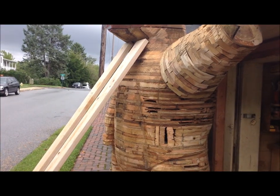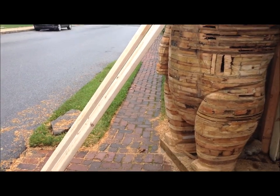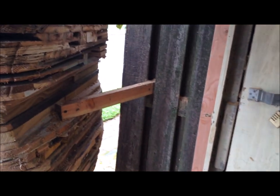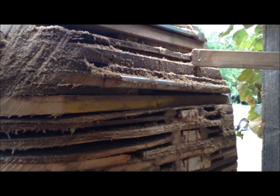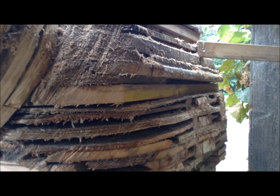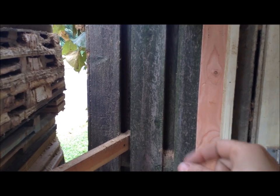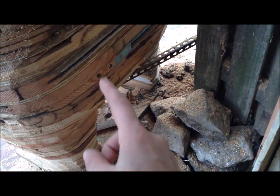So what I want to do is replace these supports I have. Once I removed those braces, I do not think this bear is going to fall over at all, but it's better to be safe than sorry, so I propped up these two 2x6s under the neck, and I've already removed one, but I'm going to remove this one as well as that one up there. I want to take my saw and flatten this back out a little better because when it rains it kind of collects all this stuff. I really want this to have a gradual slope so it doesn't collect and hold any water, and once that's done I'll make some permanent braces to go from the back to the 4x4. Then once I'm done I'll remove this piece and can finally start finishing up these legs.